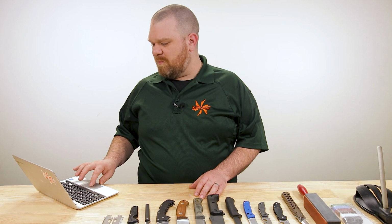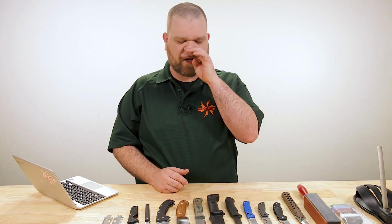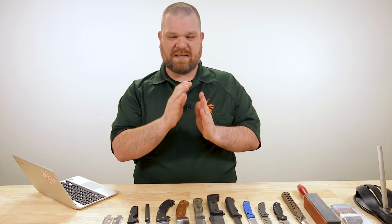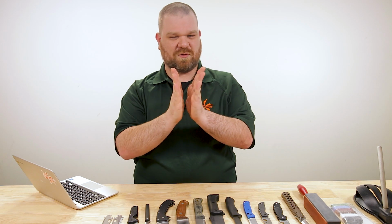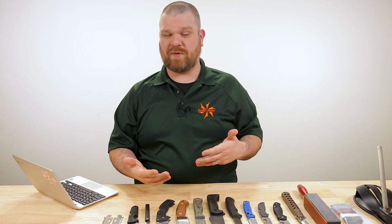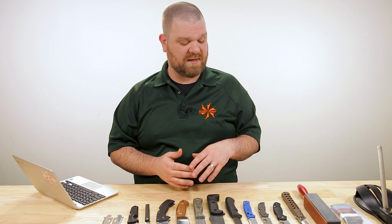Sure thing. I think I know where you're coming from with that Dozier knife. Because it's a hollow ground knife, it's going to be really thin behind the edge, but as it gets up towards the shoulder, you're going to be fighting more resistance. So for that reason, I like a full flat grind on a fairly thin blade myself.